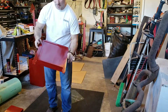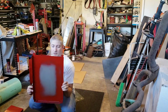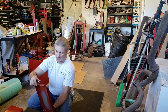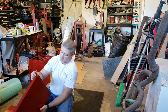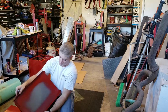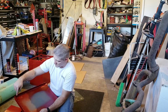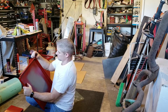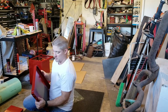Here's the bottom. All the frame is made out of inch and a quarter angle stock and some 22 gauge sheet metal. Basically just cut four sides, made a little notch in the back. I just spot welded the sheet metal on. And here in the corners I welded in another piece of angle iron, drilled and tapped it so it will receive some bolts in the back.